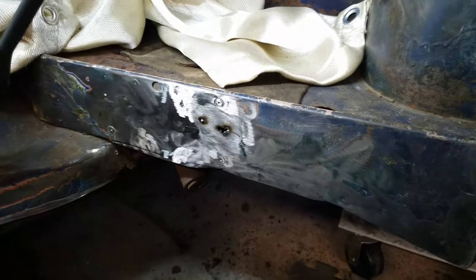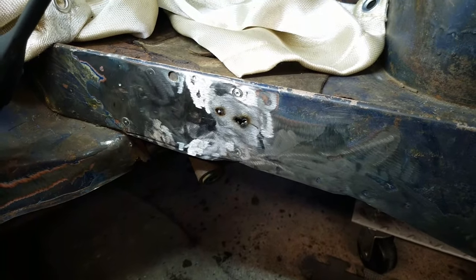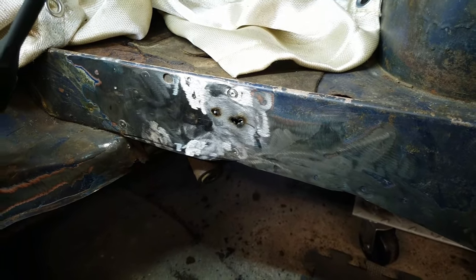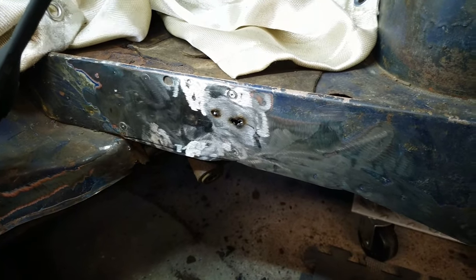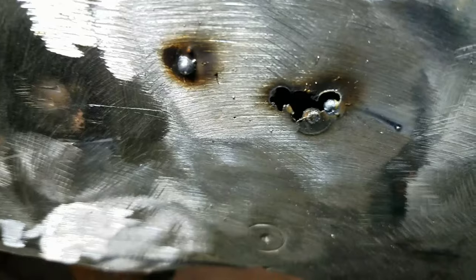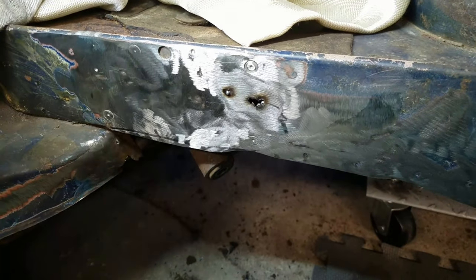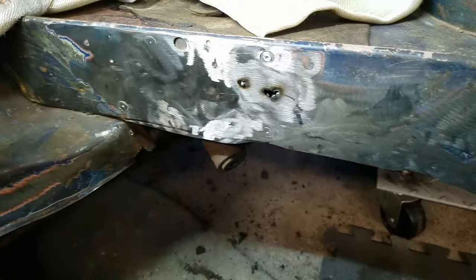It blew through again, I turned it down, and I was able to sort of refill the holes, but now I'm back to the situation where it was when I first started — blowing through every time. I know welding takes practice and I have pretty poor muscle memory, and also bad vision, so I have to get really close to see what I'm doing and then it's sort of too close for the welder and the light. Advice greatly appreciated, thanks for watching.